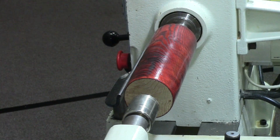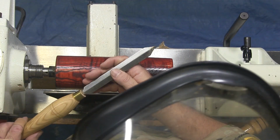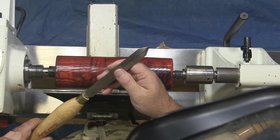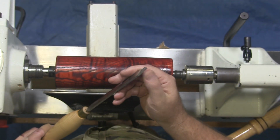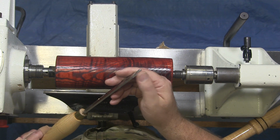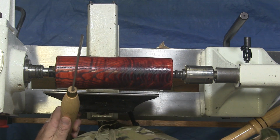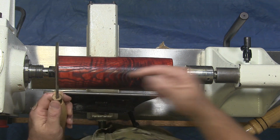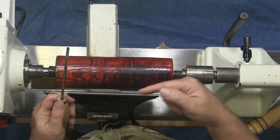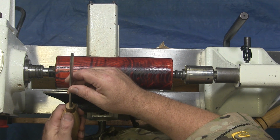The other one that would work is this diamond parting tool. Now, I didn't blue it, I promise. I bought this one secondhand. You sharpen this on your Wolverine or your grinder just at the right angle. I've got the platform, I've got a Robo Rest. Have any of you seen it? It's a guy out in Oregon, I believe. He's got the degrees set by 5. You put a little cotter pin through it. I've used it for my scraper, so I have the same thing every time.